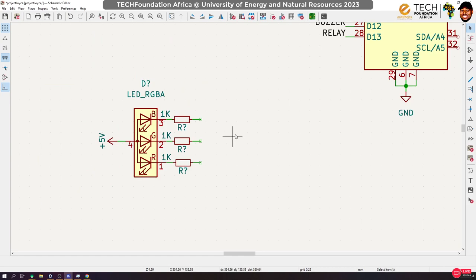Okay. So the next thing I would do to control this is to put in analog voltage. Unfortunately, we don't have an analog source on those pins. The analog pins that we have are for input only, not for output. So the way we generate analog voltage using digital is what we call PWM, pulse width modulation.